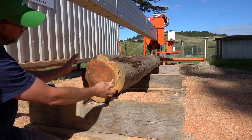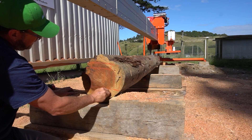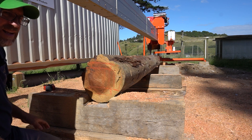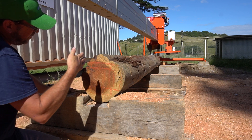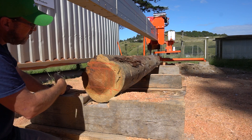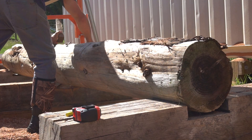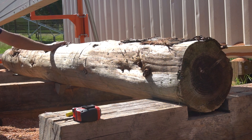There's no tendency for that log to roll, and at the very bottom I'll take another horizontal cut right here. It's important to note that you wouldn't do climb cutting with a manual machine — it's only the automated that allows you to do that. If you're using a manual machine you'd have to do your vertical cut, drive forward, move across, vertical cut, drive forward, move across, whereas the automated machine can zoom forward, reverse, forward, reverse — so it's a lot more efficient.